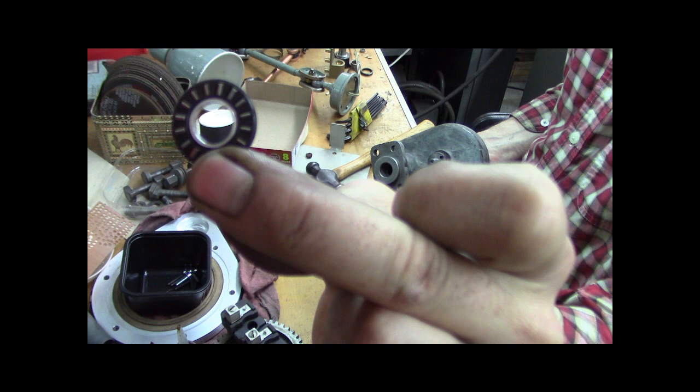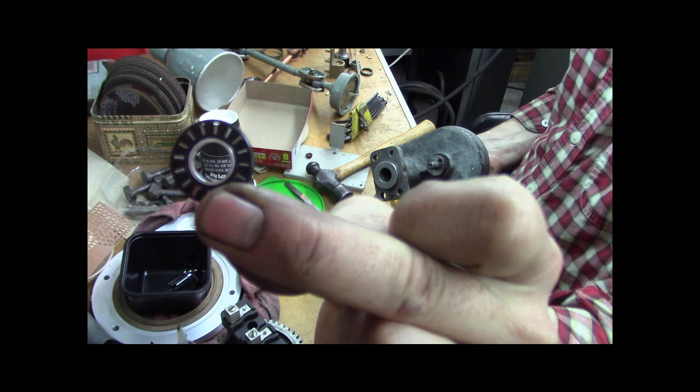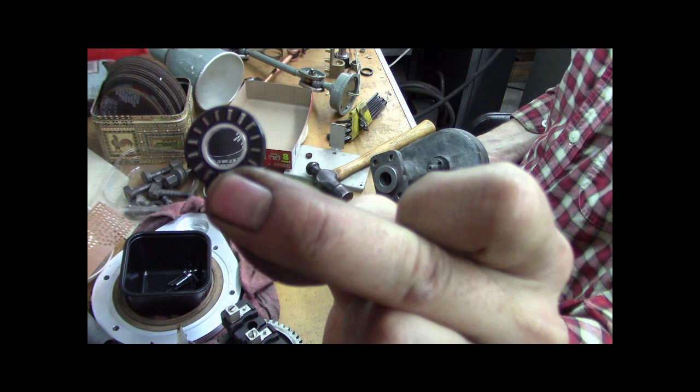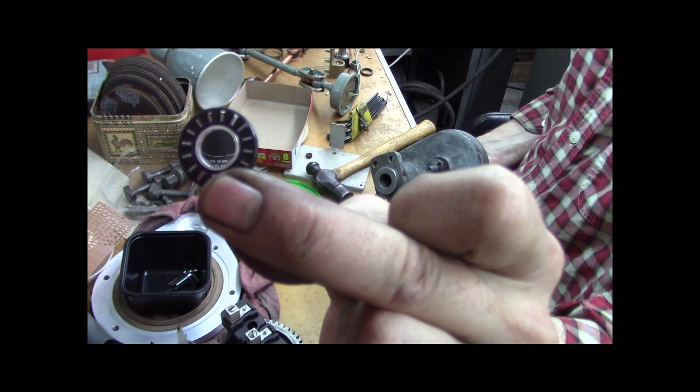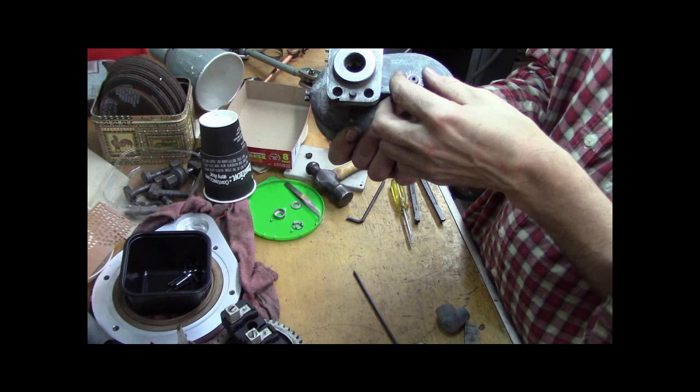So anyways, I made that little bushing on the lathe. I didn't film it. I made a little bushing because the threads where it goes on is 7/16 or 0.437. So the inside of that bushing is actually 0.431, which is the tight fit on the threads, and 0.513 is the press fit into the bore, like 0.512, whatever hole that is. So just to keep it centered, that's what that is. So that'll go on there. It's a really line-to-line fit.